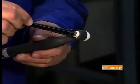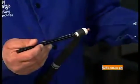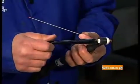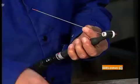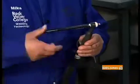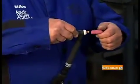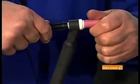We use a back cap, which allows the tungsten to insert up into it. There are a few different lengths of back caps — this is a long one, this is a short one, and you even have some stubbies even shorter than this. The shorter the back cap, the better it allows you to get into tighter places. Then we have a cup that threads onto the collet body, finger-snug.